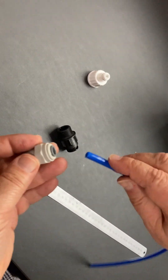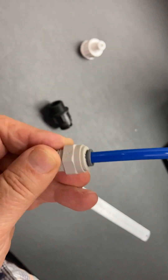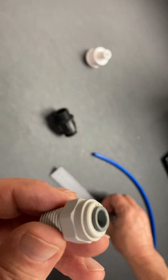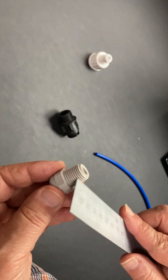To release the tube, pulling alone won't work — you have to push the collar in while you pull the tube, and there we have it, that releases it. It's called a quick-fit or speed-fit connector.